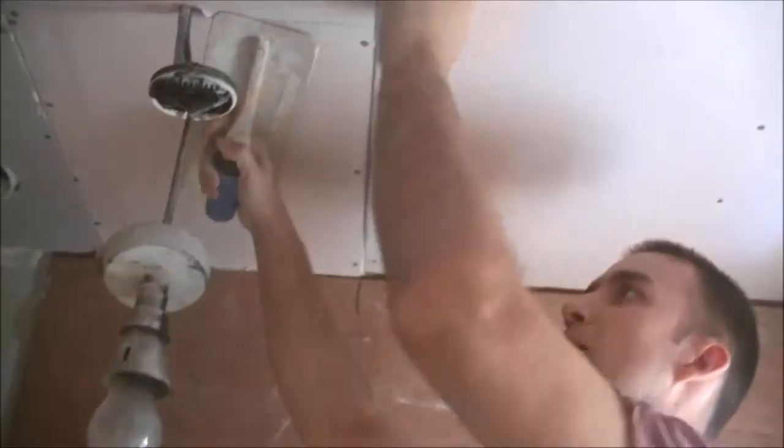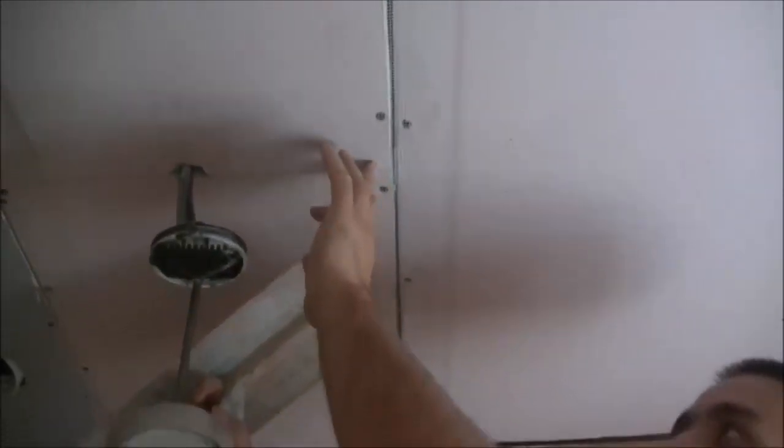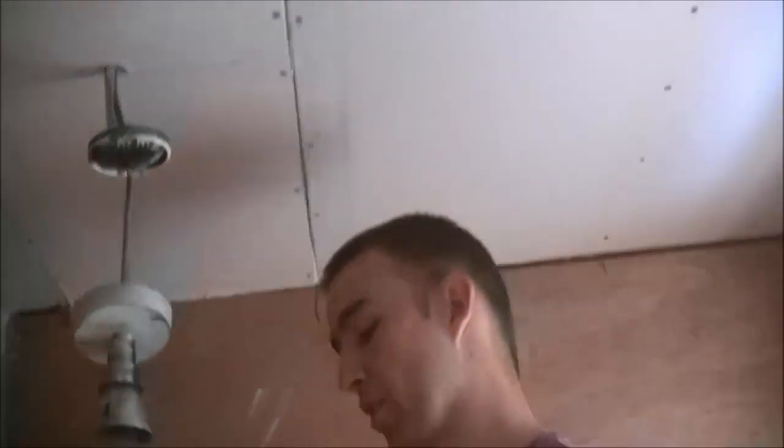I just cut it with a chisel. You can overlap it like so, but the problem with overlapping is if you've got lots of plaster on and the scrim comes off — if you overlap your scrim, all of your scrim tapes will come off and you'll have to redo them. Because it will hit the ground, it will be dirty, and it could come down round you, which will get a bit of a mess.